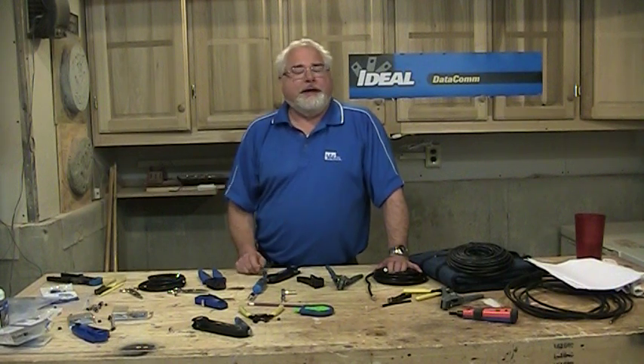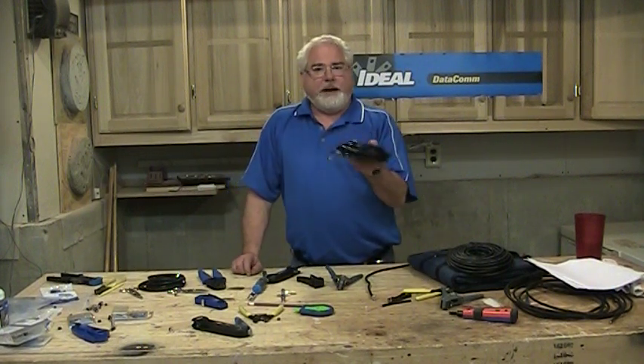All of these connections can be used on different types of coax: RG59, RG6, and RG6 quad. All three of those wires are interchangeable and are all referred to as 75 ohm cables — that's the type of cable used in those industries. And here's a dirty little secret: the coax is not always the same size.